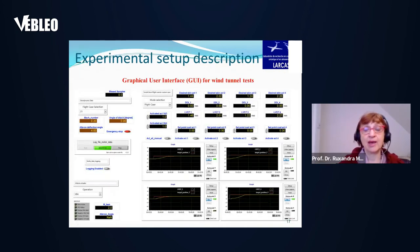Control was always done in real time in the wind tunnel during testing. The graphical user interface shows, for a certain Mach number, angle of attack, and aileron deflection angle, the desired versus the experimental control displacements for all four actuators in four windows. For each flight case, we had to observe where the displacements matched, and if everything was correct, we would move to the next flight case.